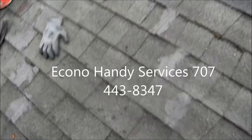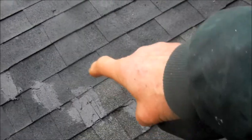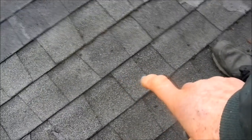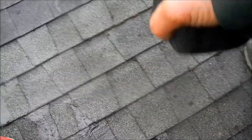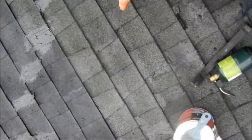So I went inside, looked to see where it was leaking — it was leaking about a foot over and three feet down, which is right here. These had the little drip seams on them that I gooped up, and then they had drip seams here that I gooped up all the way down. So theoretically it's right around here where it's leaking inside. I'm thinking these seams were leaking — could have been a nail at the drip seam — but these seams don't actually fall on the place where it was leaking. A foot over, three feet down, right about here. I'm thinking one of these drip seams was leaking.